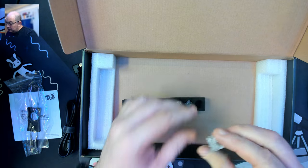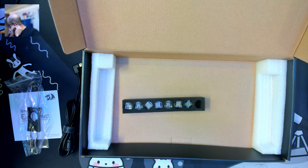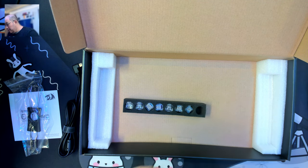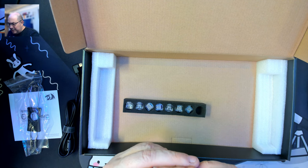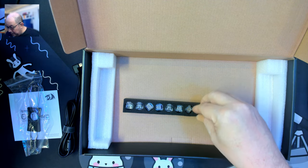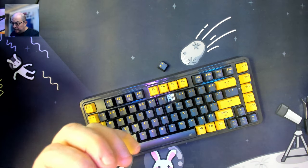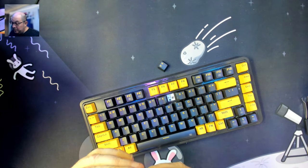We have some crystal clear switches badged with Red Dragon. They actually sound pretty good. They appear to be long pull — perhaps 3.8mm of travel. It's a very light spring, and it has a sharp yet soft, not harsh, bottom out with absolutely no ping. With the original ELF there's also another Red Dragon switch. They're not really putting out the names, so I don't know exactly what it is. It's a bit heavier linear, but again, it has no ping whatsoever.